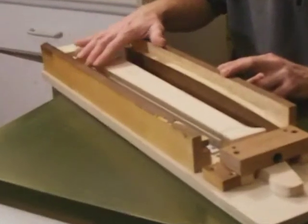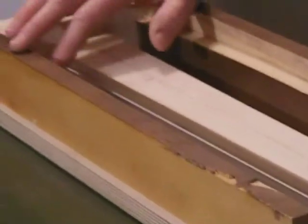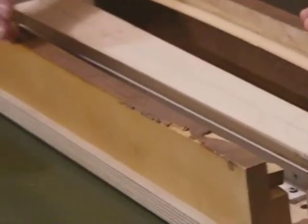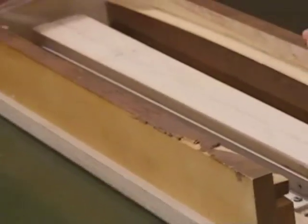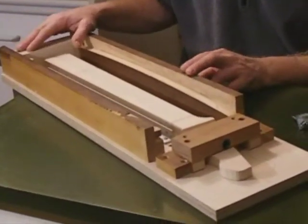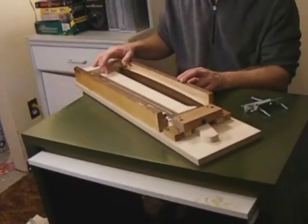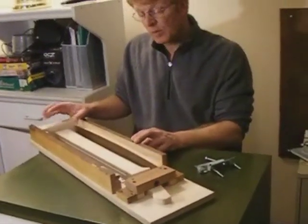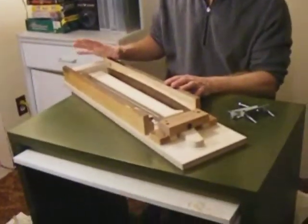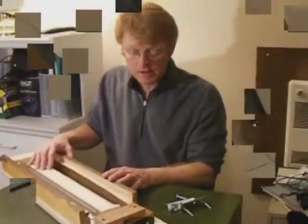For the rails, I took a pattern and routed my arc in, created a rail to the side of it out of the same piece, then mirrored it and did the same to the other side. I laid it all out, got my center lines, added my blocks and the rails, and got myself a decent little jig. Once that's all done, we can look at building the truss rod itself and installing it with the skunk strip — that will be tutorial number four.